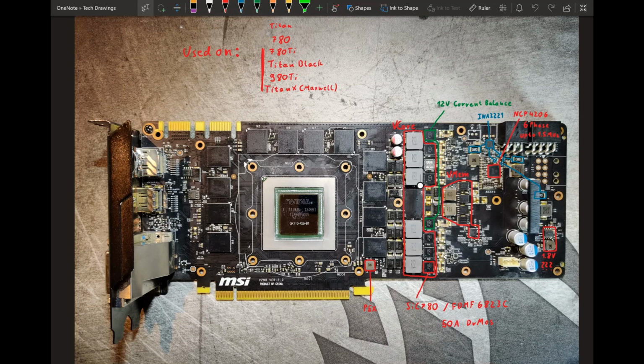Don't overvolt these. Just don't. If you have one of these, okay, you can overvolt them if you have some really good cooling on those power stages, because the more you cool them down, the more current they can handle. But if you just have a standard air heatsink or something, and the base plate is not really good, then yeah, please don't overvolt these. It's probably gonna die.